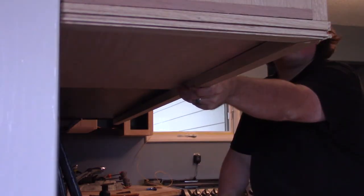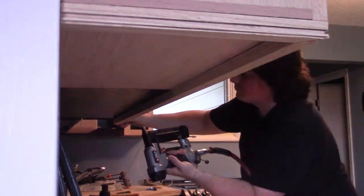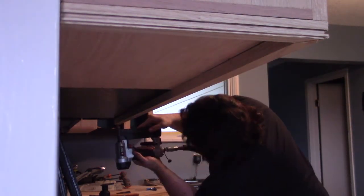Remember when I said I only needed edge banding on two and a half of the six cabinet sides? Here's the other half — I completely forgot that the adjacent cabinet was only six inches deep. Luckily I brought the edge banding with me just in case. The last cabinet to hang was the narrow cabinet. The side of the corner cabinet wasn't quite plumb, so I mounted the narrow cabinet in relation to the window frame instead and filled the gap between the corner cabinet and the narrow cabinet with effectively a big oak shim, glued to the side of the narrow cabinet. The last thing was to install the crown molding and trim, cut to size on the miter saw outside and pinned in place with the pin nailer.